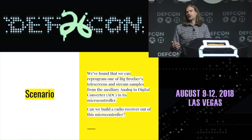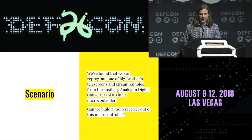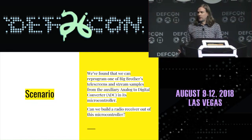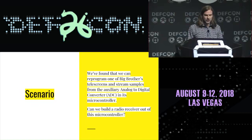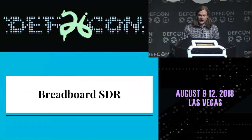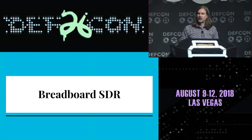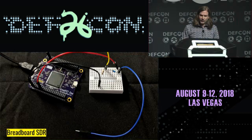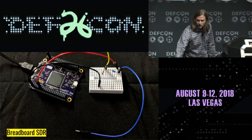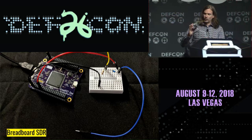Can we take a general-purpose microcontroller that has a little analog-to-digital converter in it and build a radio receiver out of it? You should be able to, in theory, take anything with an ADC and build some kind of software-defined radio out of it that we can use for general receiving purposes. And so we came up with this breadboard SDR idea. What's the smallest, simplest thing that we can make out of a microcontroller with an ADC and as few components as possible? And we have this circuit that we're about to demo that has actually one diode and one resistor.